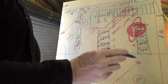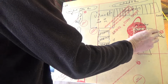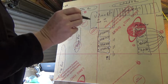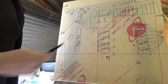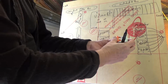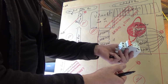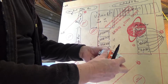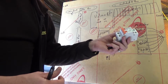So I guess it all starts with the solar panels, and they basically come into here, positive and negative into here. Now, this allows me to totally disconnect the panels, both the positive and the negative, using these 2-pole breakers. So that's a 20 amp breaker, and it's going to switch off both the positive and the negative if it ever should reach 20 amps. Or of course it means I can manually turn them off and disconnect them. You'll see these in one of my AliExpress haul videos.